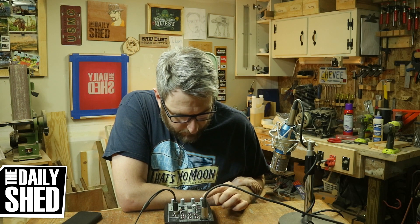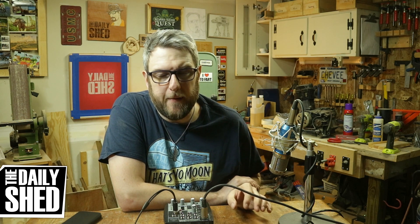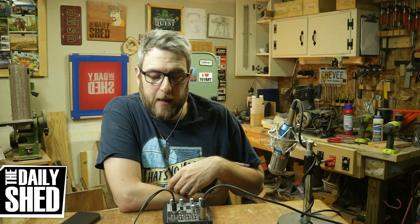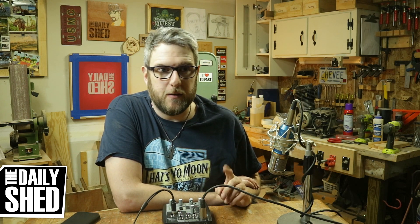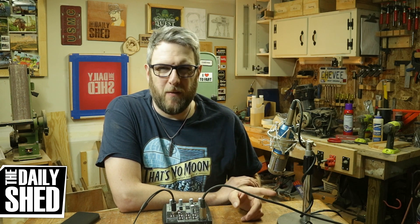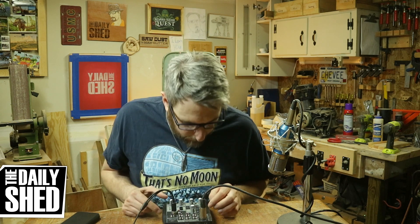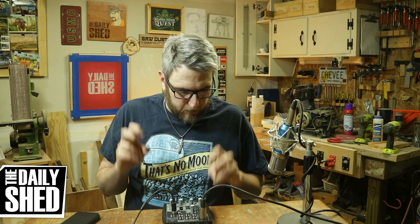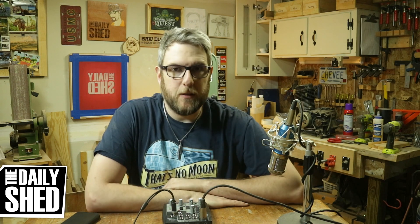What I've learned is the EQ stuff on this particular mixer — the high EQ, which is the 12kHz range — if I turn it up I get a lot of buzz. I've heard of the high pass filter, which means cutting out lows. Apparently it does that, but I'm actually putting a little bit of low back in because the lows on this mic make my voice sound a little funny. So I've turned the high frequencies down a little bit below zero, and given a little boost to the bass frequencies — maybe that's just the way my voice likes it.